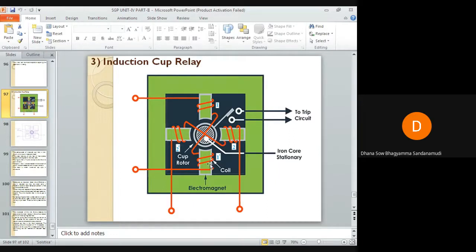You can see two pairs of coils here. Coil one is connected to coil one dash — this is one pair. Coil two is connected to coil two dash — this is another pair. So you have two pairs of coils wound to these poles.